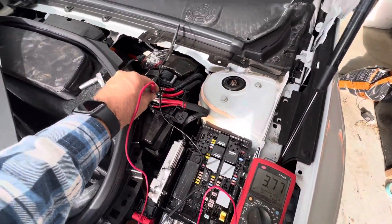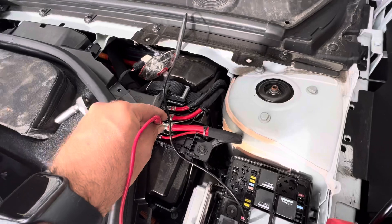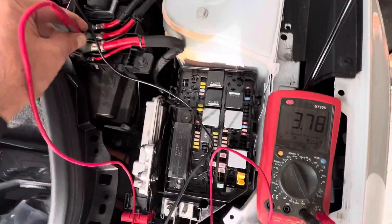I'll have to put this phone down — three hands unfortunately. I'm just going to pop the negative lead on here and see what we get. Okay, so that's showing 3.76 volts. Learn how to grow a third hand! As you can see, it's only 3.7 volts, so the main battery definitely won't have enough charge to get things going.